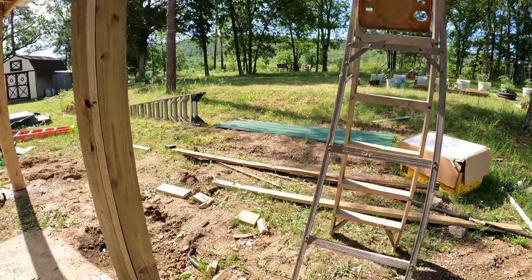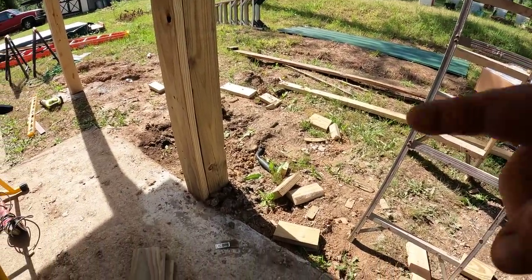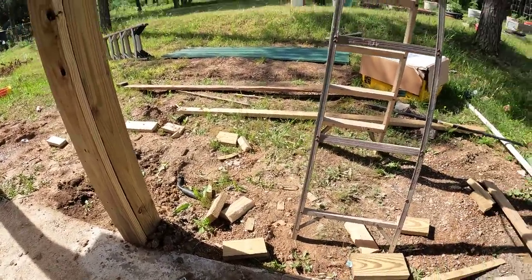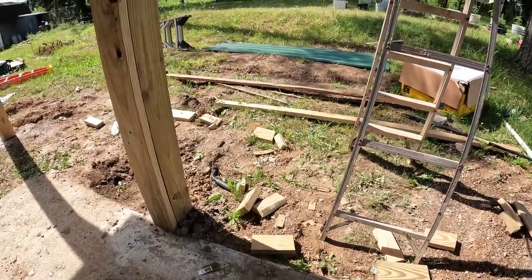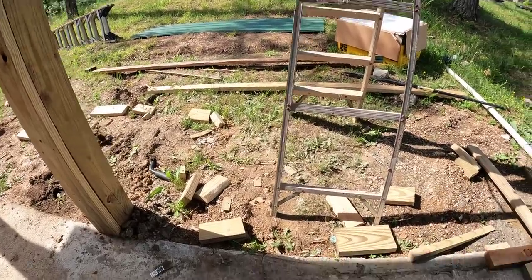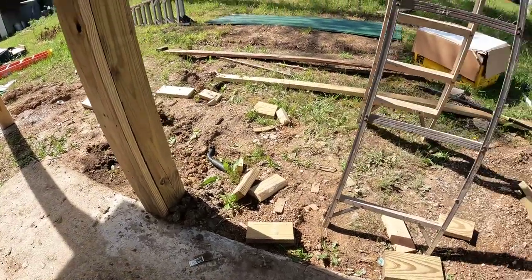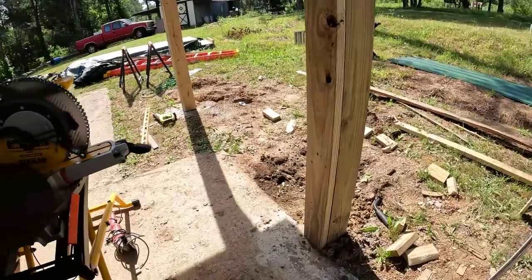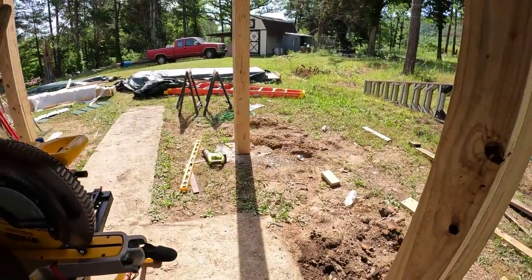What I'm going to start on now is getting ready to frame. I want it to go out a little further than where the concrete ends. I've got four or five loads of gravel coming - they were supposed to come yesterday but didn't. So I'm going to dig this down a little bit and fill it in with gravel so that when I frame it in, it's not sitting in the dirt. I may put pavers in there, but for now gravel.